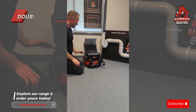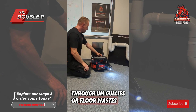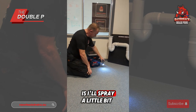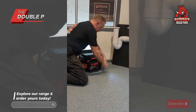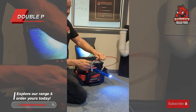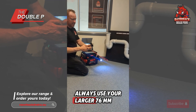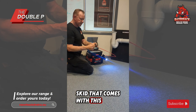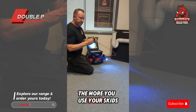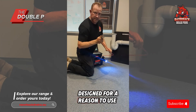A lot of people I speak to are apprehensive about putting their cameras through gullies or floor waste, so I just want to show you how I do it and how simple it is. One trick is to spray a little bit of silicone spray onto your camera head, onto the skid, and onto the back of the cable — just gives it a little bit more slipperiness. When going through gullies, always use your larger 76mm skid that comes with this. It stops the camera head from pushing back over itself, gives it a bit more support.